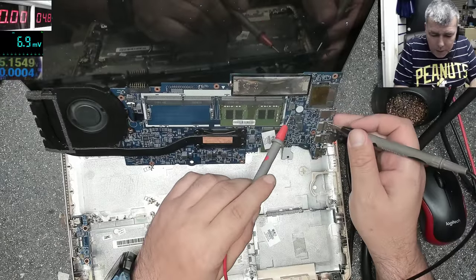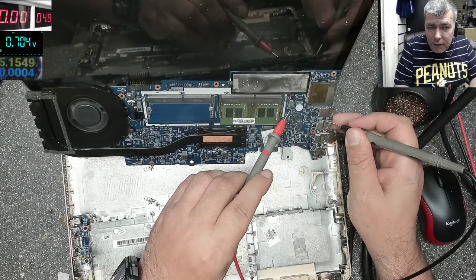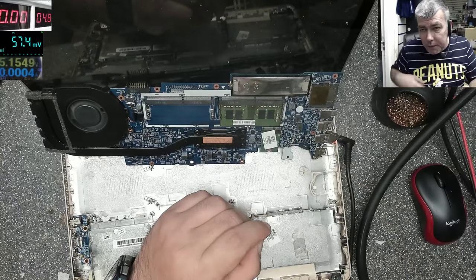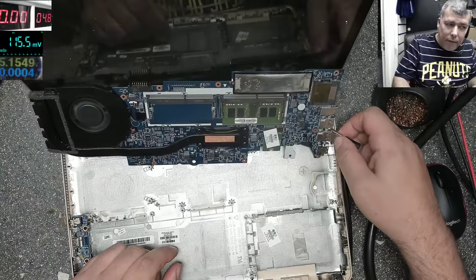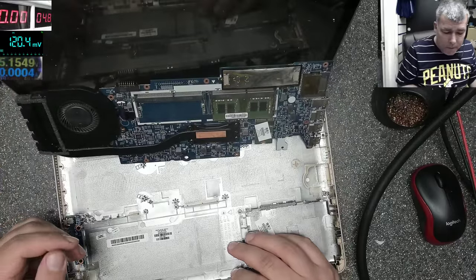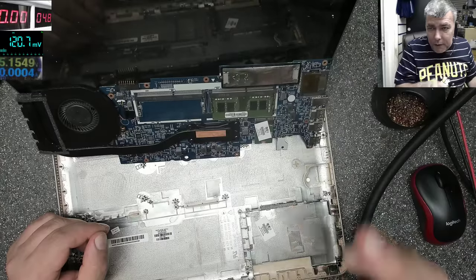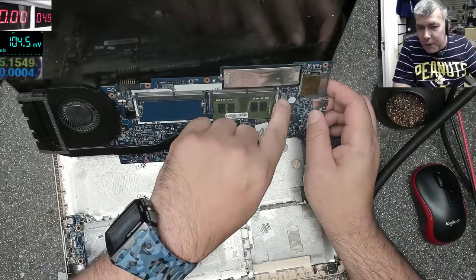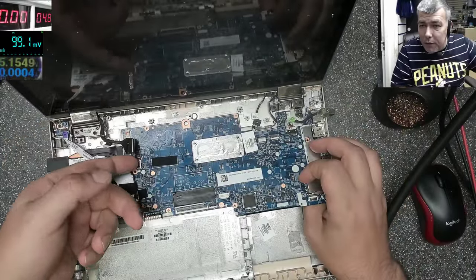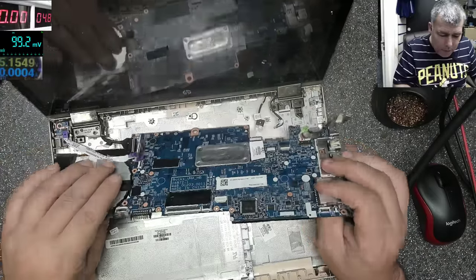The power supply of the RAM is this one, you can see 0.7, yeah, 0.7, it's a little bit too low for the RAM. And DDR4 should be between 1.2 and 1.4 volts. And the problem with this kind of thing is, when you have a chip there, you go online and check the chip data sheet to see exactly what the chip is doing and what you can check.